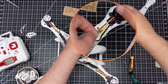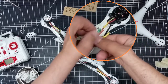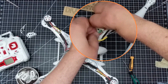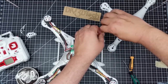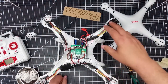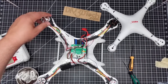Right here is the issue — make sure I get the battery undone. These two wires had pulled out from the electronic speed controller. I'm going to plug them back in. These are kind of loose fitting — a little bit surprising. I'd recommend some heat shrink tubing over these to hold them in place, because that was the problem with this one.